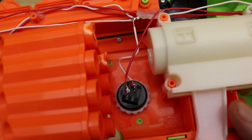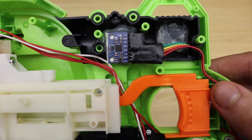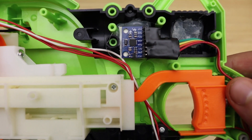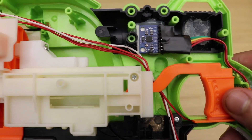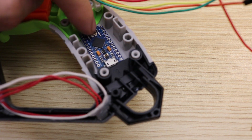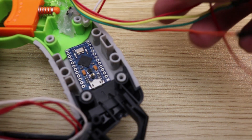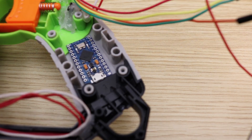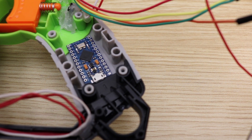Here is the small arcade button that was wired in. And up here in the corner, we have the MPU-6050, which is the combination gyroscope and accelerometer used for aiming as well as diving. Aside from the joystick, the only component I have left to place is the microcontroller, which I'll be putting inside the handle so that all components will be completely internal and give a really clean-looking design once fully assembled. All those miscellaneous wires will need to be soldered to individual pins, and then a single micro-USB cable will connect to the header.